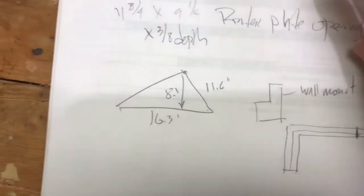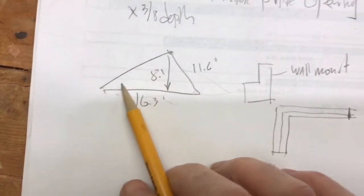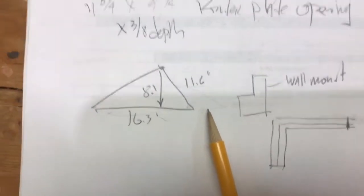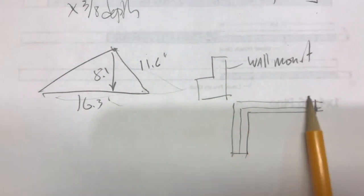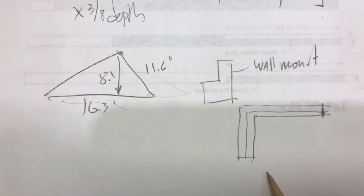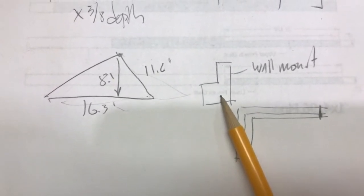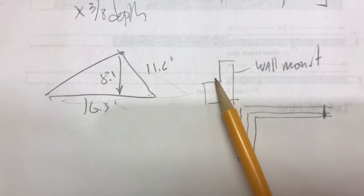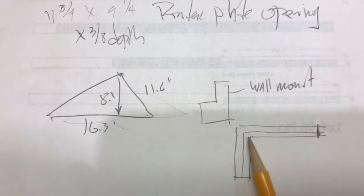It's going to be nothing more than a little right angle, approximately these dimensions. I've got these off of a little Amazon corner shelf. The wall mount will be inside the corner and the shelf will go across like this. The wall mount will have a lip that the shelf will fit into and just sit on top of. You screw this piece into the wall. Let's get to making that piece right now.